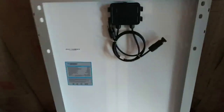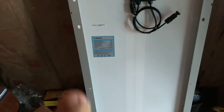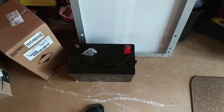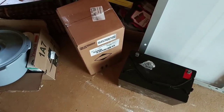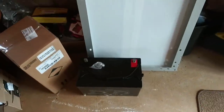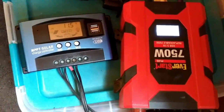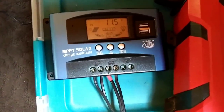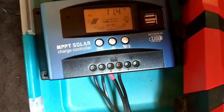As far as solar goes, these are my two new solar panels. They have different connectors and I did not buy the right ones. I need two adapters and two connectors. That's my new battery — it's a 100 amp hour sealed AGM battery, deep cycle. And here's the new charge controller I got. My solar area is a disaster. I'm using a small inverter right now. I've got a 2000-watt inverter but the fan quit working. This new one is supposed to be an MPPT solar charge controller — it was only about 28 bucks and is supposed to be more efficient.